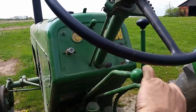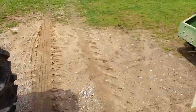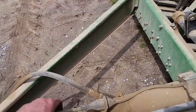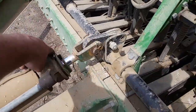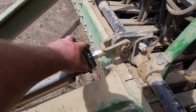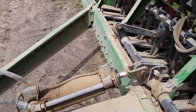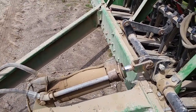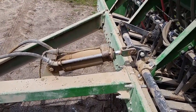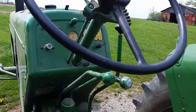Just like normal — up, down. If you wanted to change the stop collar, right back here, if you had an actual hydroelectric cylinder there was a cable that ran back to it and went in here. It has a micro switch up here — no electromagnet in here. When you held the lever to the side, that would hold the stop collar so you could adjust where it was in case you wanted to adjust your stopping depth. Then the rest of the time you just had to hit the lever and it would go all the way up, or coming down until it hit that stop collar. This one works just fine, so I'm going to demonstrate it.